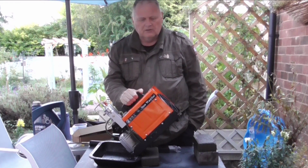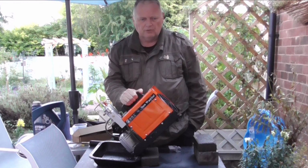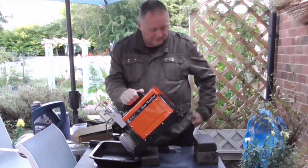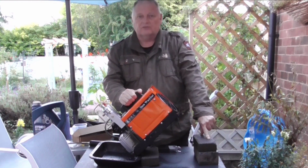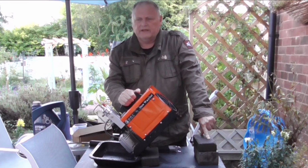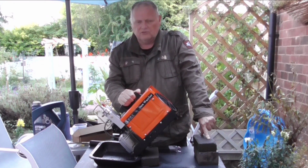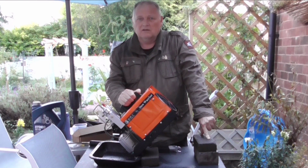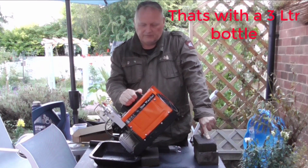Like I say, they're not really designed for fully charging air tanks. If you want to do that, you need the 2-stage compressor, which you can buy for around £500, which is well worth it if the idea is just to fill tanks. But it's okay for topping your dive bottles up. Like I say, from about 180 bar to 290, it will take you about 8 minutes. But usually, when it gets down to around 200 bar, I'll top it up to 280, and that's taking me about 5 minutes with this, which is pretty good.